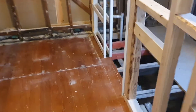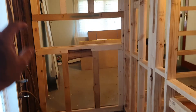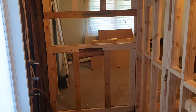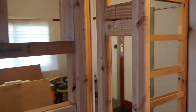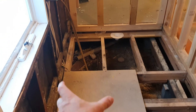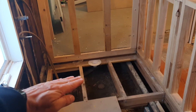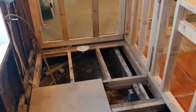I'll go in here and show you now. On this side here you've got your shower across the back wall — that's a really big niche for your shampoo bottles and the like. The shower head will be on that wall there. You can see we've back blocked and marked for the water outlet for the shower there, and then obviously the mixer goes there. You basically walk into the shower and around. There'll be a strip grate that goes all the way across because that floor will fall away from where you walk in — water should always be falling away.